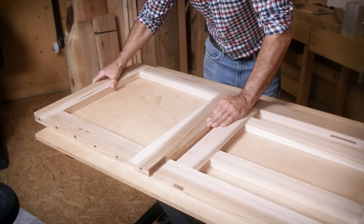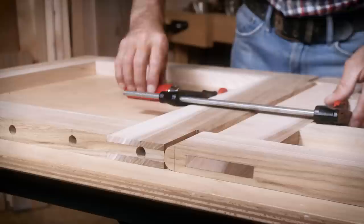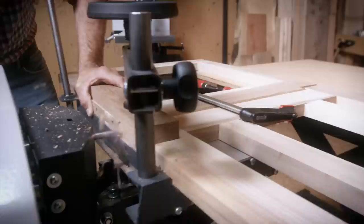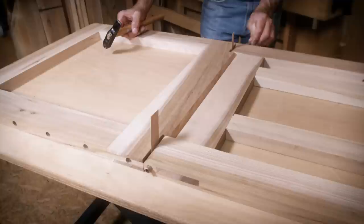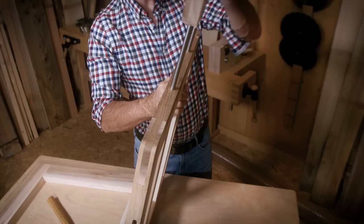The holes for the hinge are bored in the seat and backrest at the same time. A piece of veneer provides some clearance at the hinge. Here too, drill as deep as possible. Everything fits perfectly.